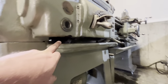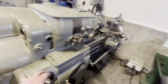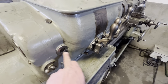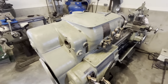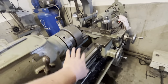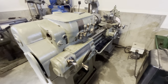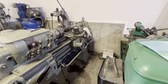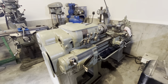The quick change reservoir is a little more exposed and open — mine tends to drip a bit, so I've had to add some to it. Unlike the oil cups that go to reservoirs, the individual oil cups are ones you oil periodically and fairly frequently as you're using the machine. The three headstock reservoirs plus the quick change reservoir are essentially fill-once and monitor, unless they're leaking.